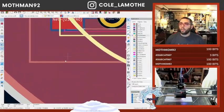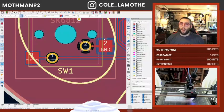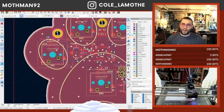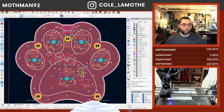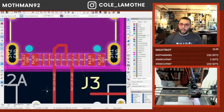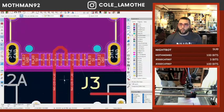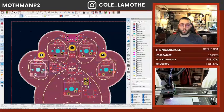You can actually see that we have both a flat pad and a hole. The flat pad is for surface mount soldering key switch sockets. The hole is for direct soldering key switches, if you so chose. I'm going to locate our connections at the back end here, because USB-C is a reversible standard — if you don't do that, you will not have a reversible USB-C connector.